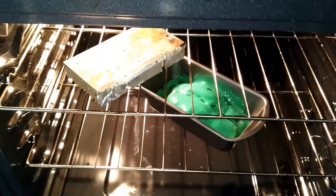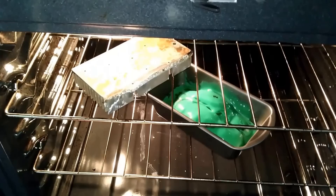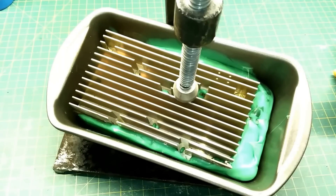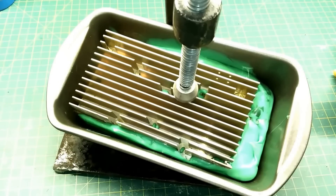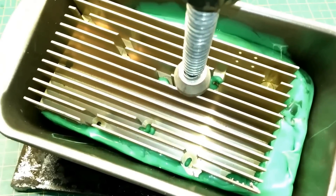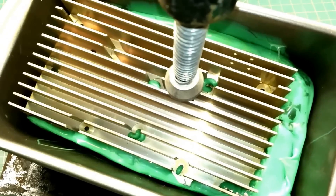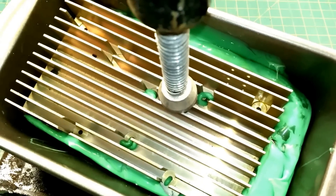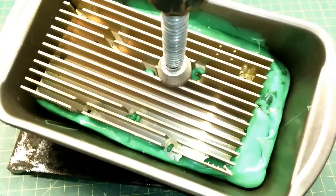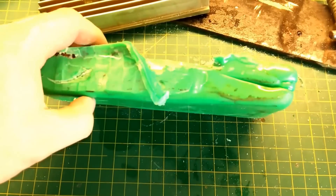It's been about 20 minutes and it's probably 350 degrees throughout, so we're going to take it out to the garage and put the heat sink on it. I've pressed the heat sink down on top of the HDPE with the c-clamp about as tight as I could get it. You can see it did ooze, which tells me this is extrudable — you could probably melt and extrude or form parts. But right now we just want a flat piece of stock to work with, and that's what we ended up with.